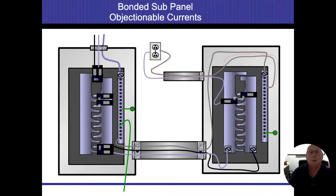So what we're going to do is energize that outlet again. So we're going to be doing work. Amperage does not disappear. So we're going to energize our energized conductor, and then amperage will be on the neutral. Electricity is going to flow by any means possible. All right. So yes, it is going to flow on the neutral. No doubt on that. But because I'm bonded there as well, I'm putting a connection to my electrical panel. Electricity is also going to be flowing on my electrical panel as well, all right?